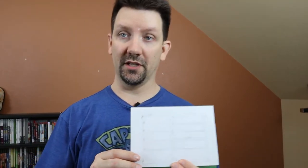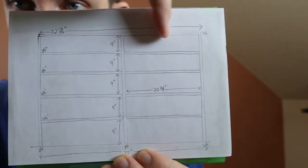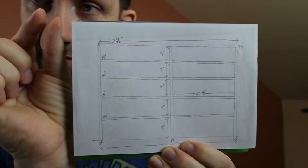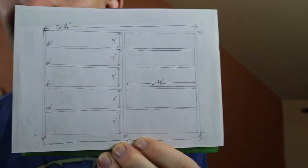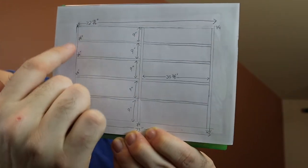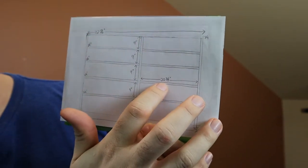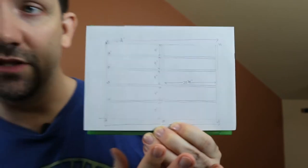You want to make sure you've got your measurements exact before you start sawing up wood. We've got our measurements here. I'm going to zoom in to show you my sketching. Since this board on top has to be a little shorter, I've got it labeled at 72 and 3/16 of an inch so that the little edge on the side will line up. But overall from end to end it's 73 inches, 9 inches in between each section, accounting for 3/4 inch wood all the way through. Each section in between will be 35 and 3/8 of an inch between those two posts. So we'll go down and start measuring some wood and doing some cutting and see how we turn out.